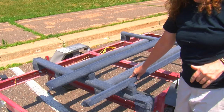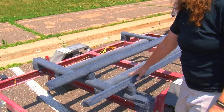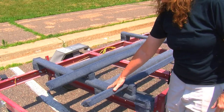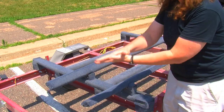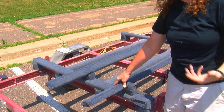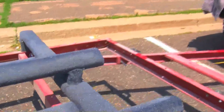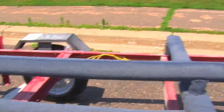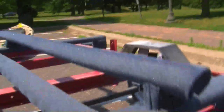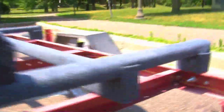If you saw a previous video of mine, I had re-sided our shed and dog-ear fence pickets are only like $2 a piece. So what I did was I put them on the table saw, split them up the middle, and then put two pieces together and screwed them together to basically make like a 2x3. These are 6 feet long, less the dog-ear, and I added three more of them underneath here just to layer it on so it all rests on something.